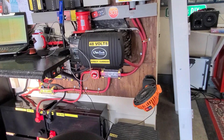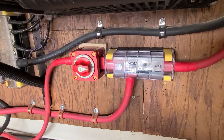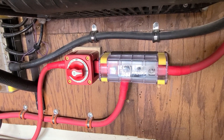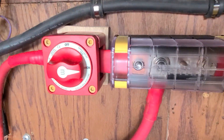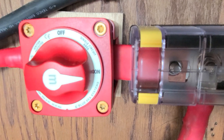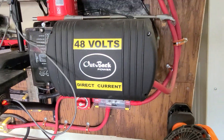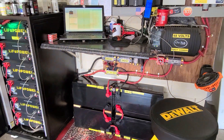I had a four-post bus bar from Blue Sea that I cleaned up and reused. Right in the middle is a copper bus bar going directly into the switch, which worked out perfectly — that way you don't need a piece of wire and two lug ends, you just use a solid piece of copper.